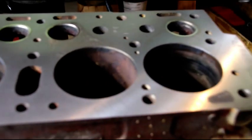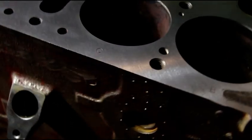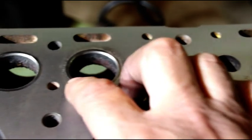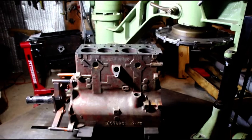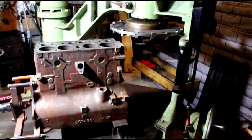The block cleaned up quicker than I thought — a second pass of one and a half thousandths cleaned it up. Hard to see but the numbers are still in there. Very good finish on that; the whole thing cleaned up nice. The hardened factory seats in the exhaust were no problem for the machine — it cut those without any trouble. Super happy with the Blockmaster, and I hope you guys enjoyed seeing it work. I've got plenty more engines going on that soon — about nine to do.